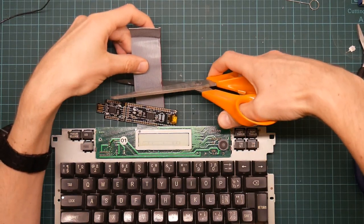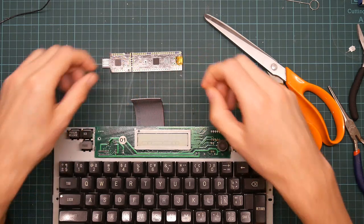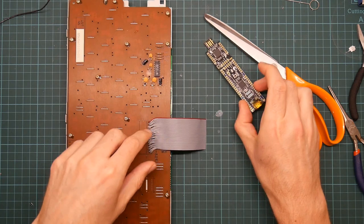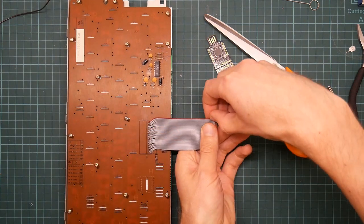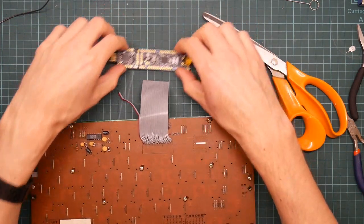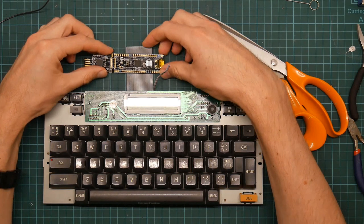So the first thing we do is we trim the cable. Like so. And now we need to start sorting out which wires go what. Now, it's been soldered down so that pin 1 is the red stripe in the normal fashion. Pins 1 and 2 are ground and power, which are the ones that go on the end. So we want to peel these off first. And peel them down to about here. The rest of the wires are going to go alternately to the top and bottom of the board. So they'll be soldered on about here-ish.